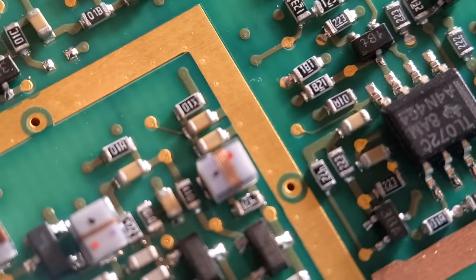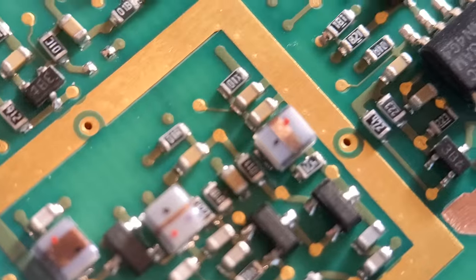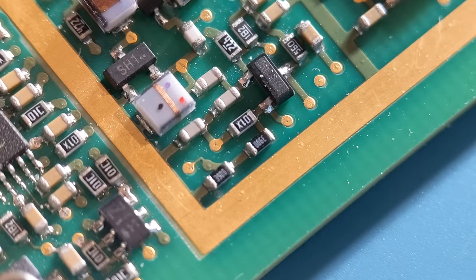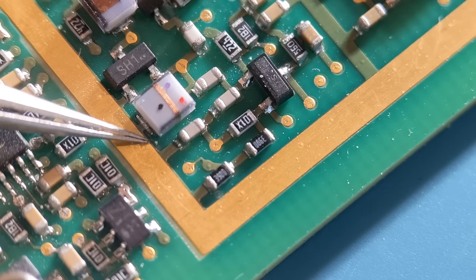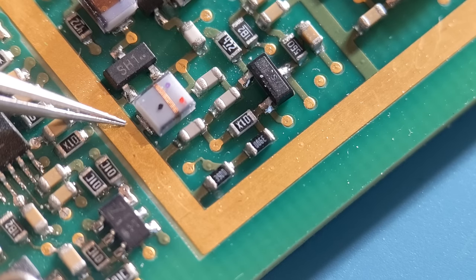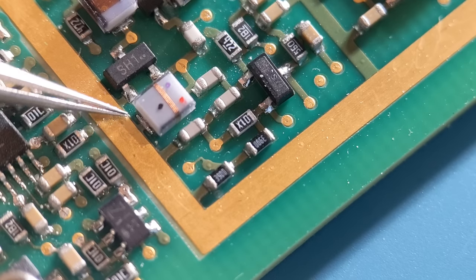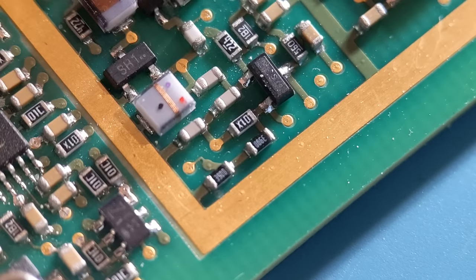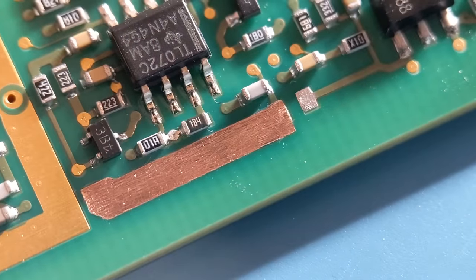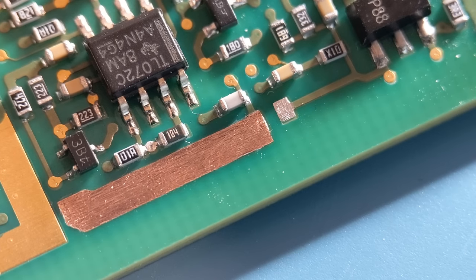So if you haven't got resist, use your Kapton and you get the results you need. Coming down to this area, I've got this large gold trace around the outside of all these components. Sometimes that'll have a metal can on it, or maybe it just doesn't need solder on it at all. Down in this corner I've got an inductor — very small amount of resist there. If that resist weren't there, the solder from this inductor is going to spill out over to this large gold trace. So Kapton it up and you'll stop it spilling where you don't want it to. I'll get that component Kapton'd up and come back shortly to do the soldering.